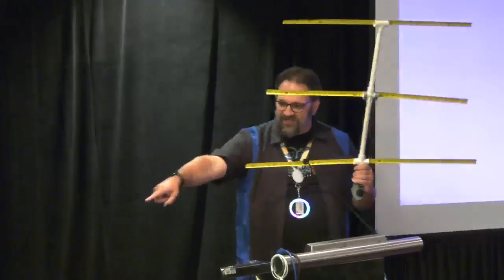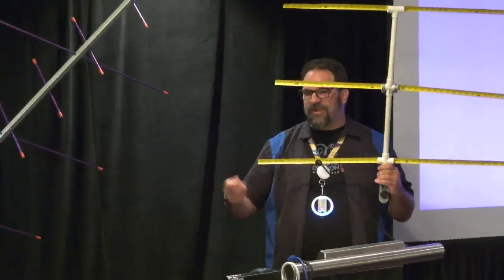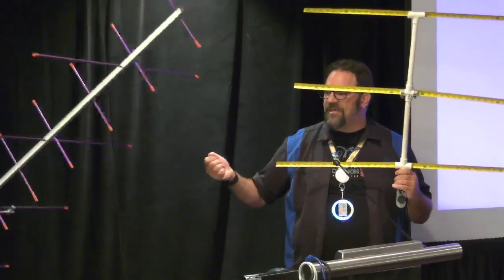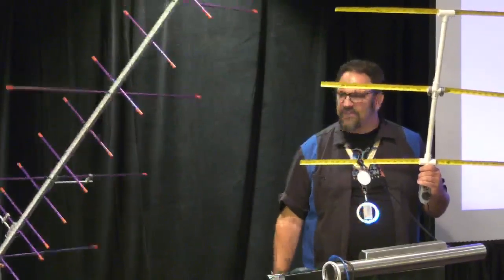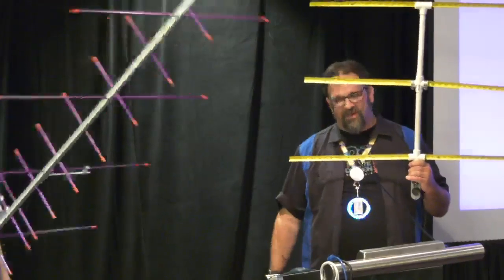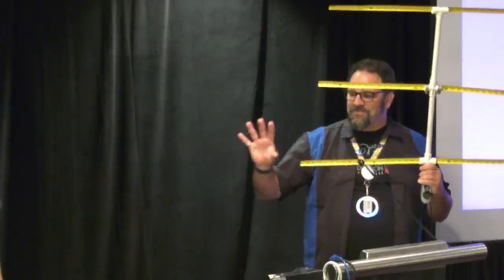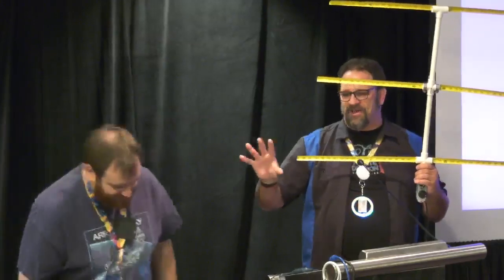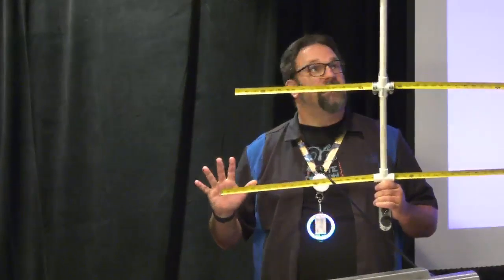Whereas that arrow antenna, those are firm aluminum elements, and they're great if you're doing satellite work because it's very precise. But if you're running around a forest with that thing, you're going to get caught up on trees and everything. Or a DEFCON hallway, and attendees in LineCon and all that kind of stuff. So those are great antennas for some things, but not great for T-hunts. So the tape measure Yagi is a great design.